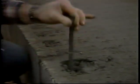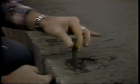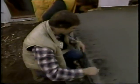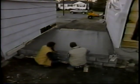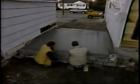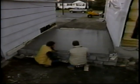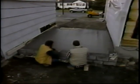So we want to push these down about 1 3/4 to 2 inches in from this outside wall, and maybe let them stick up about 2 to 3 inches so they'll end up right in the middle of a 2x4 that comes across there. Now, if you run short a little bit, you can pick up some of the cement on the edges from your wheelbarrow. I like to keep this a little bit low here, Bob, around these anchor bolts so that it doesn't stick up and interfere with our plate, or our sill, so that it's nice and tight to the blocks. All right, so they're close to the top of the 2x4.